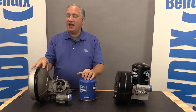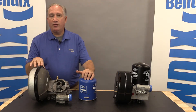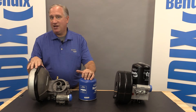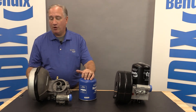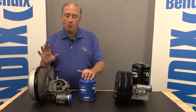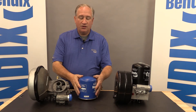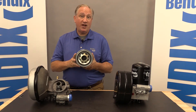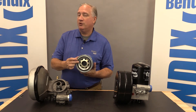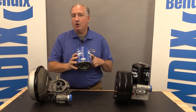When I move over to the new ADHF, you'll see some big changes. First, this is a two-piece casting, so it's about eight pounds lighter. The two pieces are retained with a retaining band and a shoulder bolt. You never want to take this retaining band off or that shoulder bolt off — there's nothing to be serviced inside here, and if you touch it, that voids the warranty. One of the other design considerations with the ADHF was to be 100% oil coalescing, so this dryer comes standard with a Pure Guard cartridge. But the mounting interface is a little different — it's a 41 millimeter thread.